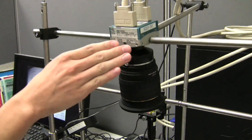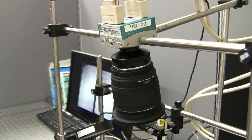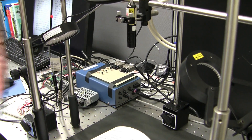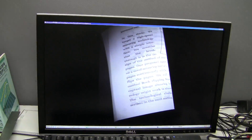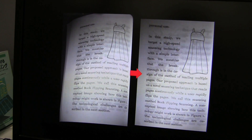This is a high-speed camera and the resolution is 1000 by 1000. This is just normal light, and this light is switching at each respective frame. So when this light is projecting here, the shape is obtained by this camera. The whole information will be collected to the PC, and the PC will calculate the shape and also reconstruct the flat page information from the shape model. So that's all.